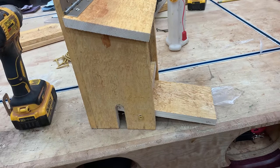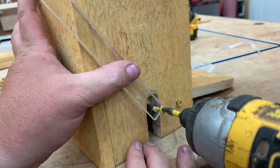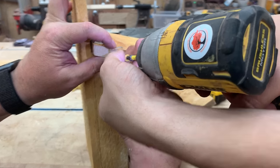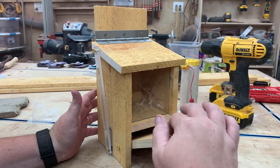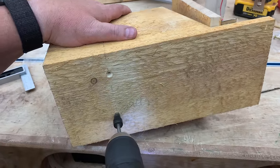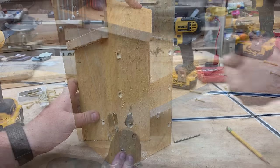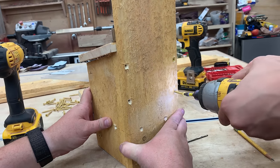I've also used a ceramic-coated deck screw — this is a screw that will never rust or corrode outdoors. These screws are made by Deckmate and are actually the screws I use for almost all of my woodworking projects. Now for the lid mechanism — another deck screw here, a little bit longer, and I have a small piece of thin plastic tube helping keep that screw head offset from the back. Anything similar works — just something like a straw, but a little bit more stout. We'll put this into the lid and leave that loose. You can see how it works — when the squirrel stands there, it lifts the lid. Now I'm following up throughout the whole box with deck screws — inch and five-eighths for the remainder of the box — getting a couple into each joint all the way around. I'm using a countersink bit for everything so I can bury the screw head flat. This is going to make this little box practically indestructible — it'll last forever. I've built these and they've lasted 25 years outdoors, no problem.